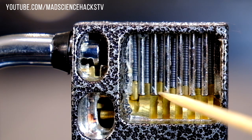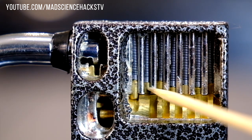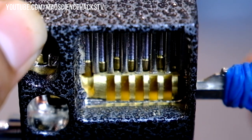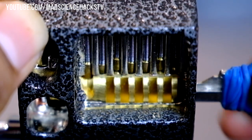You may have noticed these pins as well — these are the driver pins. They have a spring behind them and they basically drive themselves into the plug preventing it from turning. If you use an incorrect key or don't push in the key all the way, the driver pins will push into the plug and prevent it from turning.